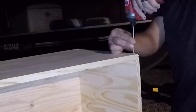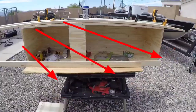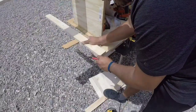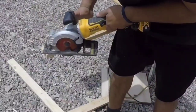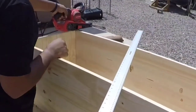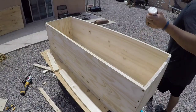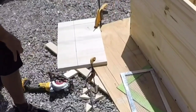We also used wood glue between all the pieces we screwed together, which substantially strengthened this. To mount the top piece, we used the same method — glue seamed in everywhere. We ran the other end cuts to the front where we needed spacers for the framing and for the door to mount on. We're going to run a big long window and a short little door for quick access, plus a top hatch that sits on a spring prop. I got around needing bigger tools by using a five-and-a-half inch circular saw, an orbital sander, and a belt sander, which works really well for leveling out uneven spots. Then we ran wood glue everywhere and eventually used plastic wood as filler.